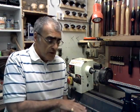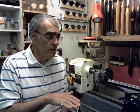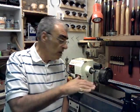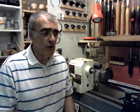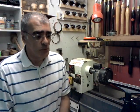This particular lathe I had to raise about four inches because I'm nearly six foot two — well, I was six foot two but I've shrunk a little with age, so I'm about six foot one and a half. The optimum height they say for the spindle is at your elbow when you're standing with your elbow in that position, because that is the most comfortable position to do your woodturning — less stress on your back. So I raised it and it's bolted to the floor.